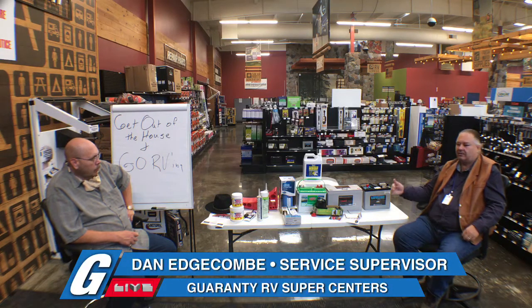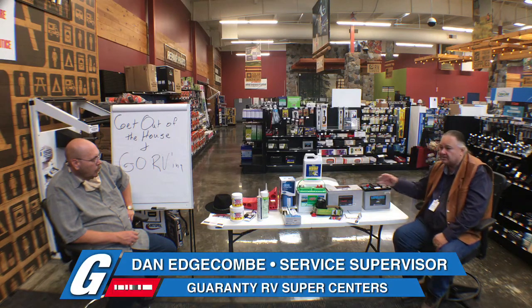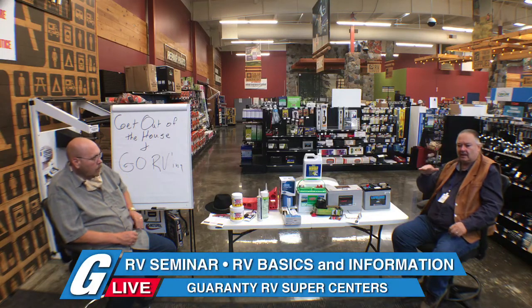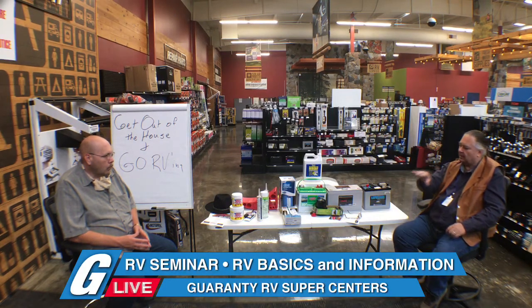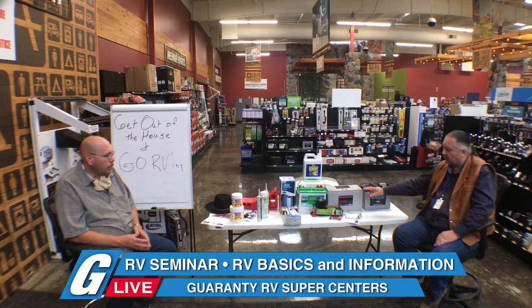In supplying an inverter, at the same rated capacity of 100 amp hours, lithium seems to do much better because of that consistent output. Even the best AGMs start out at 12.25 and keep dropping until they hit 11.5. The power you're getting down at 11.5 isn't equal to the power at 12.25. Lithium has the same potential output all the way across the board — and to us, that's been the real kicker, though they are quite a bit of money.